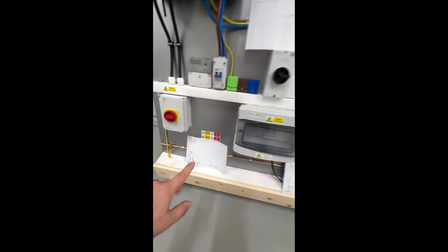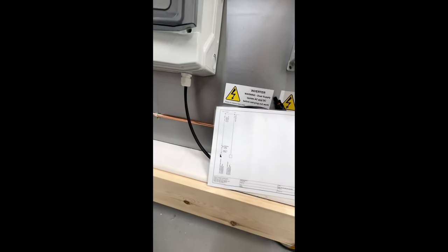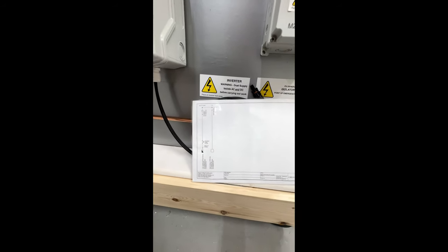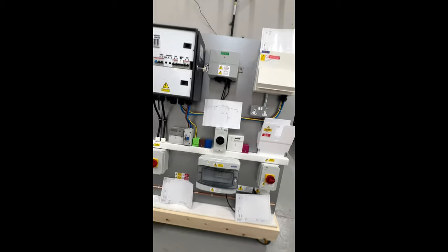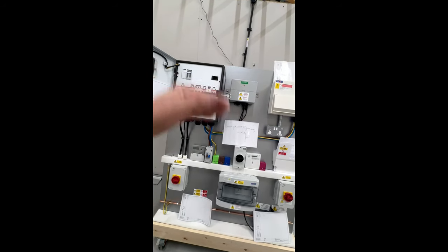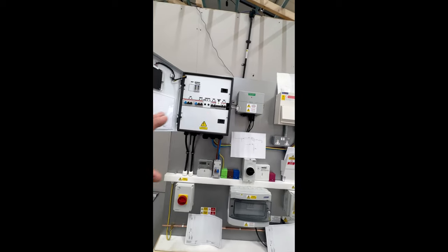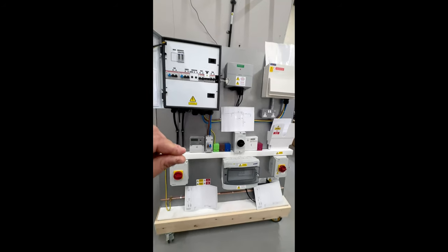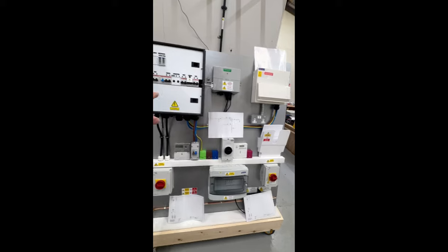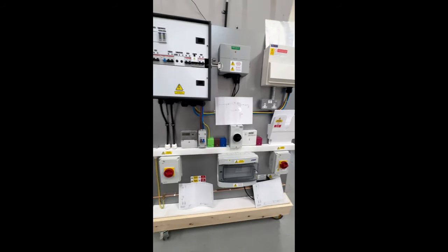That is something that is super important for us installing renewable systems. At the bottom we've got the line chart for the AC coupled battery system and the PV inverter if ever there to live in these locations, including the solar panel aspect. We've suggested a single solar panel because I don't fancy setting up a whole array at an Electrics show or an Installer Show. If you are coming onto the stand to have a look at this, understanding the direction of energy flow and where you're making an isolation — and for what purpose — at both AC and DC is super important. The changes to bi-directional RCDs with amendment three may not correlate directly to that, but it's in and around it. If you're at Electrics and interested in looking at these devices and understanding the differences — come on and have a look. It doesn't have to be about isolation. I'm there for the conversation at any level around all of that.